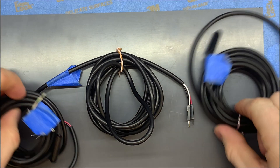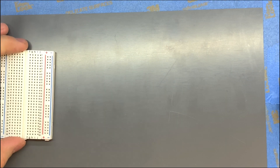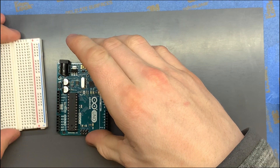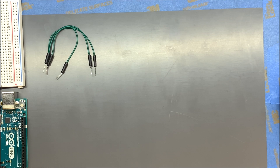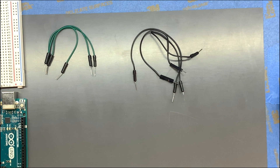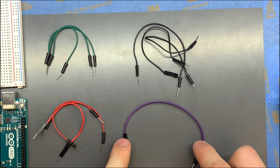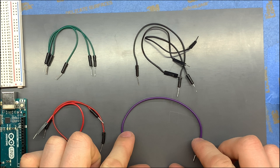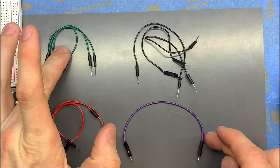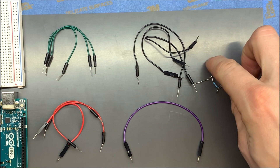To get started we're going to need three Dallas temperature sensors, one breadboard, and one Arduino. We're going to need three green jumper cables — I like to use green for data — three black jumper cables, three reds, and one purple. Because of the way these Dallas temperature sensors can be hooked up and all go back to one pin on the Arduino, the green wires will feed all sensor data into the purple, which then feeds it into the Arduino. We'll also need three 10,000 ohm resistors.